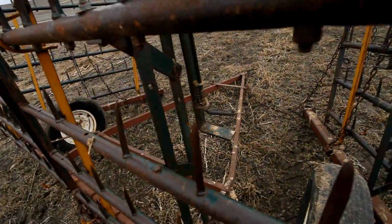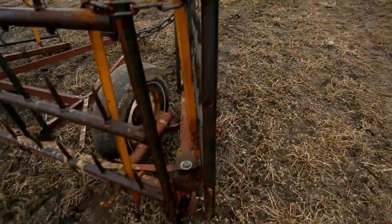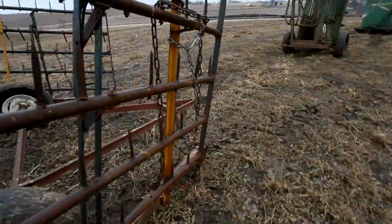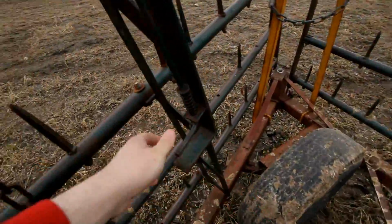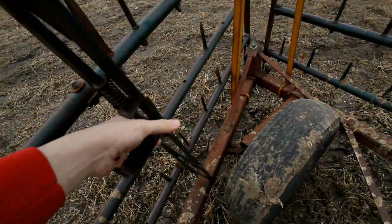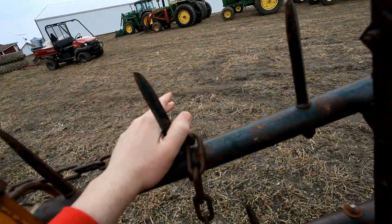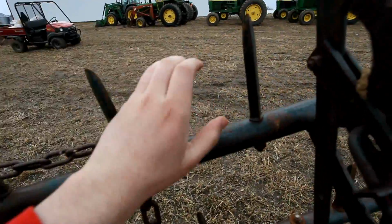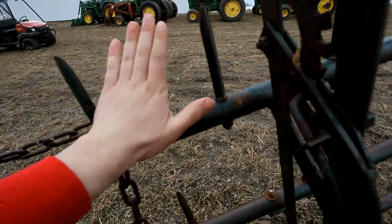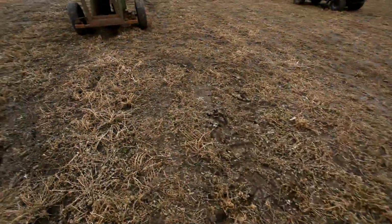But over here on top of each panel, there's 4 panels, which the outside 2 swing out. What this does is you pull down on this and then you can move the handle up and down, which controls the pitch of the tines. So as I lift up on this, then the tines would point down and it's more aggressive on the ground and it flattens it out more.